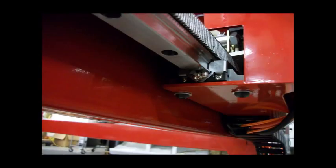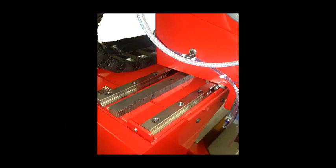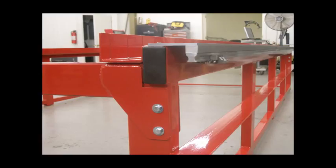The master side of the gantry rides on 25mm linear bearings with two bearing blocks — the same size and type of rail used for large high-end systems including machining centers, lasers, and lathes. It's the good stuff: hardened and ground to tight tolerances with recirculating ball blocks, assuring super smooth operation and locking the gantry to the frame. Cheap systems use cam follower bearings that ride on flat stock or even sheet metal, pressing dirt, spatter, and cutting dust into the running surface causing the machine to run rough. That is just not value — it's low cost, low performance. Cutting good parts requires smooth guides. Go for the best.